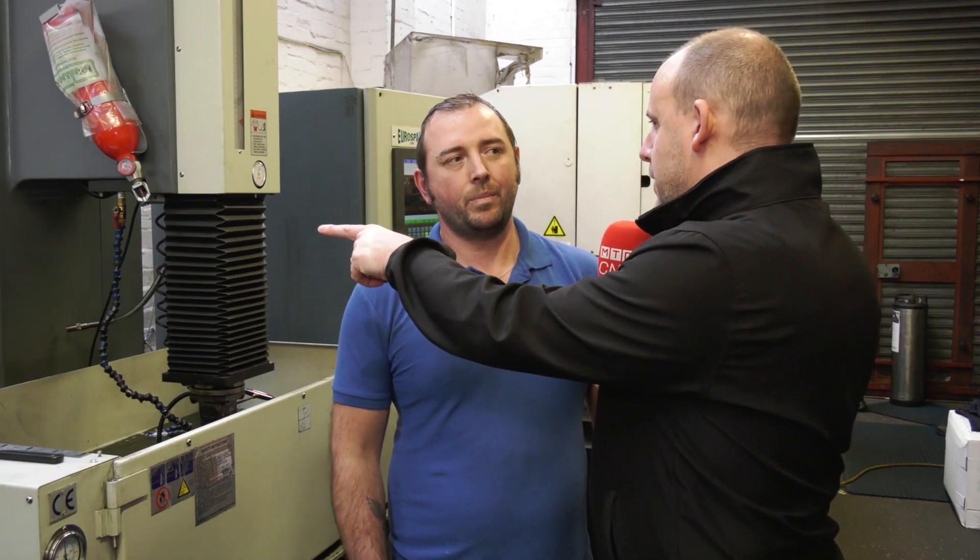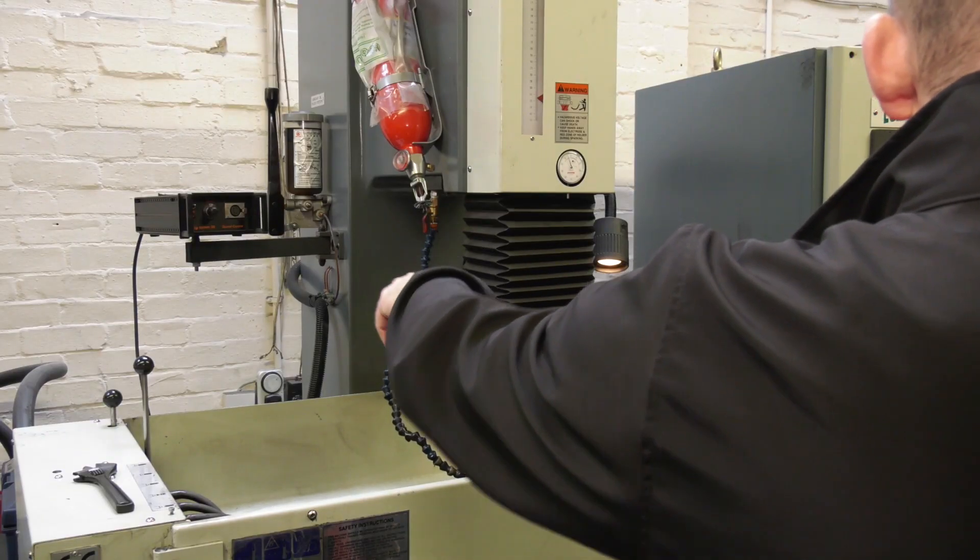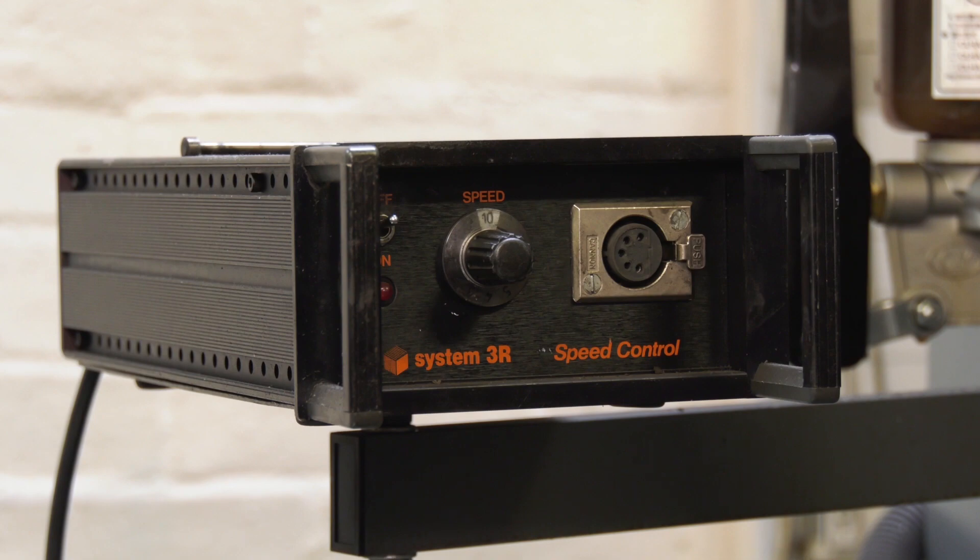And what is this System 3R solution here — what's the purpose of it? Basically it's a rotating spindle. So if you're putting holes in jobs or anything like that, it's actually rotating the tube so you don't get any carbon buildup on it or make the hole cut out of size or elliptical — so it's full precision. Is that an option with EuroSpark on this Jomars machine? Yeah, it is an optional extra — a lot of the standard stuff is flat pallet, which you do get with it.